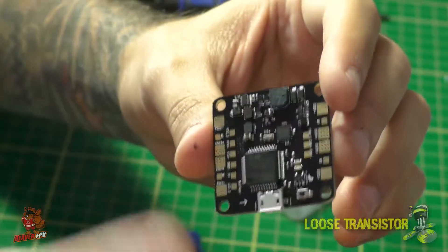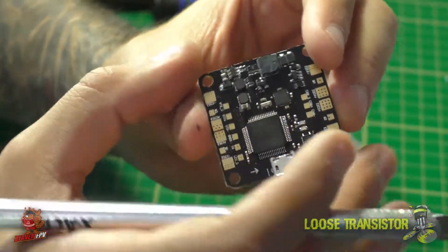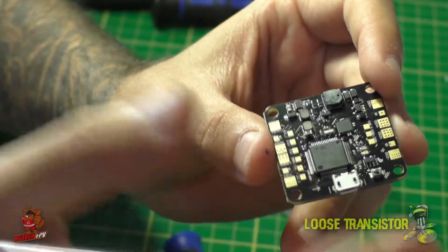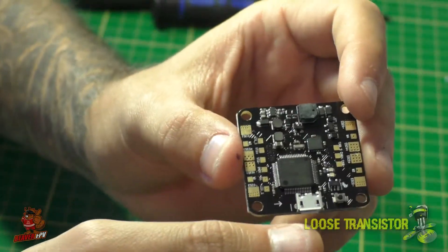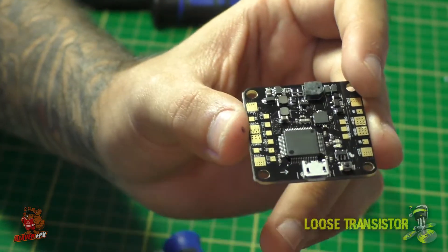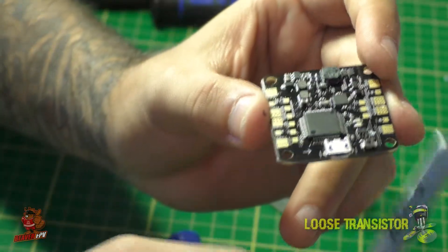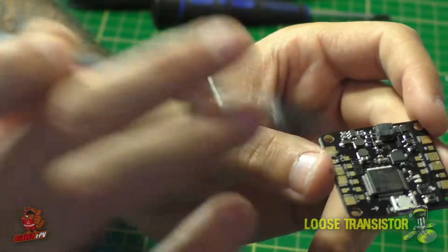On the top side of the board there's a built-in buzzer. However, this board is very new and ships with Betaflight 3.1.7, and that code has a few caveats. The buzzer doesn't quite work — it just clicks — which is a bit annoying, though I tend to disable buzzers anyway. Also, if you want to use LED strip and DShot together you won't be able to on 3.1.7. As soon as 3.2 comes out — or if you run the 3.2 nightly builds — all of that is fixed and the buzzer works fine. I've been running mine on 3.1.7 and 3.2 and both have been running great with no worries, aside from the buzzer issue.